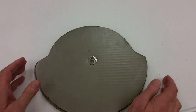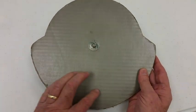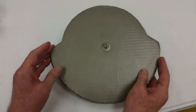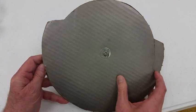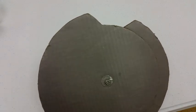To understand the cams on the timer, think of a circle with a high side and a low side. If we put two such circles together and rotate them against each other, we can control the size of the low side — it makes a notch.